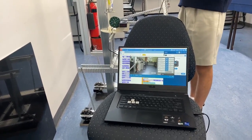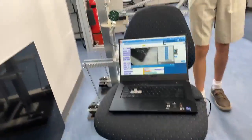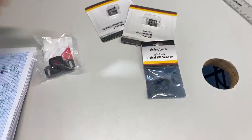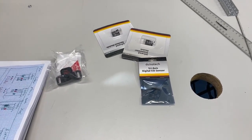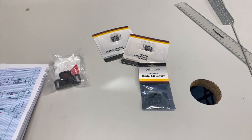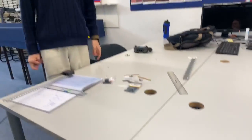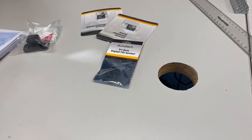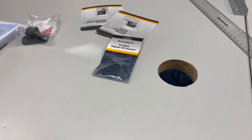And then you've got some other sensors there. What was the point of those ones? We had a tilt sensor, which we were thinking of using for the navigation of the robot, to make sure you turn exactly the right amount so it doesn't mess up. We didn't use it because it turns out that you have to use VEX components with the VEX stuff. We thought we could wire it like an Arduino, but it didn't work.